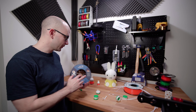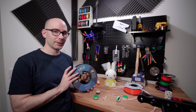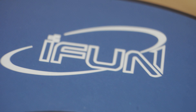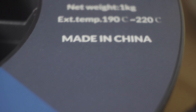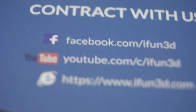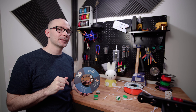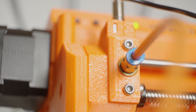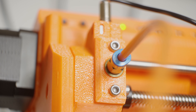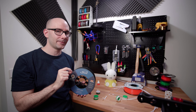I printed the first couple with iFun filament, and I'm going to say now — iFun is a really crappy filament for me. I don't know if it was the temperature I was printing at, but for whatever reason I had terrible stringing, and it's not good for multi-material printing. These strings were hair-thin, and the MMU would still pick up that something was in there, and I'd have to undo the little nut that leads from the MMU unit to the extruder and get tiny tweezers just to reach in and pull out this thin strand of filament.